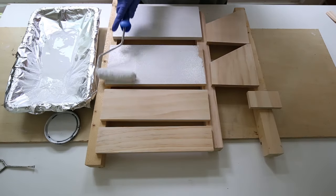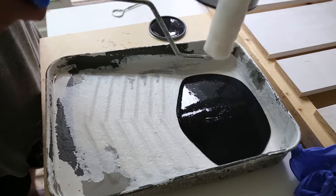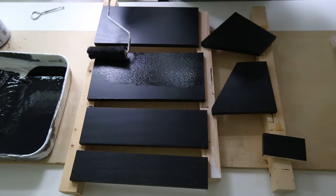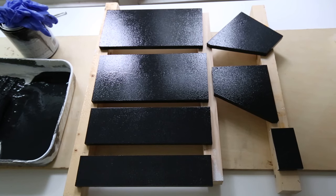You can stain or paint the desk organizer. I chose to do a black paint — I used some paint I had on hand already, it was Tricorn Black by Sherwin-Williams. I love how the black paint finish looks on top of our stained DIY wood desk top that we built previously, and I just think the combo of the wood and the black is just beautiful together. If you're painting as well, apply one coat of primer to the boards and let it dry. Then apply two coats of paint and let it dry between each coat. Make sure to prime and paint both sides and edges of all the pieces that are going to show — this includes all of the boards except for one of the one by six boards at eleven and a half inches, since the back side of it won't be showing as it's going to sit on top of the desk.